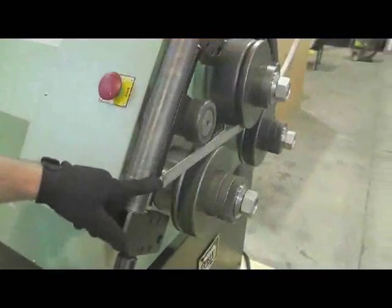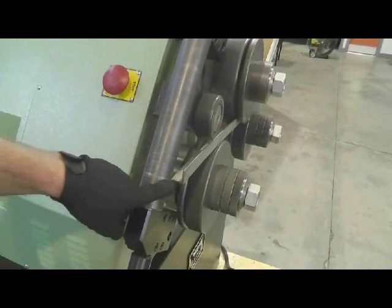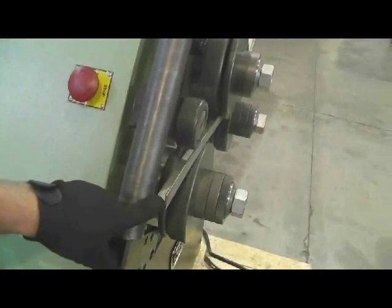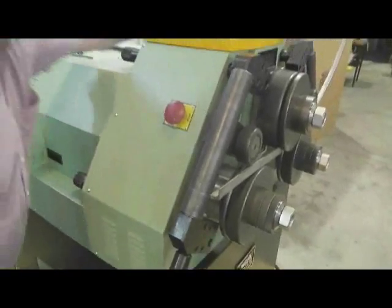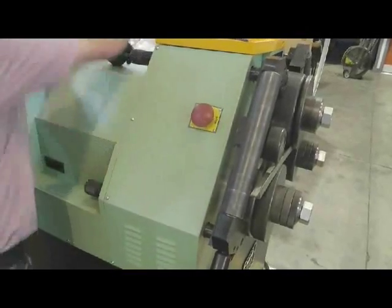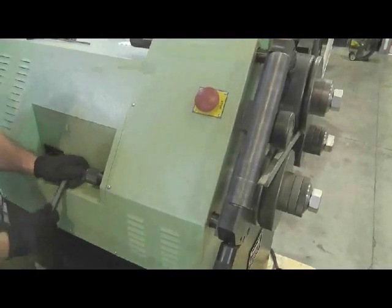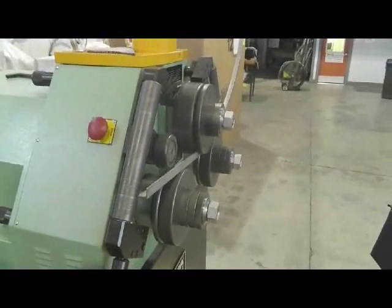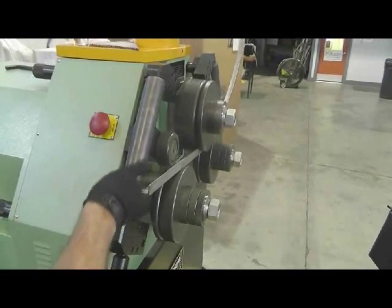With this small angle — it's actually smaller than the cam roller here — instead of using the long roller to help guide the material through, I'm going to back this up and engage the cam roller to capture the profile and hold it in line. I'll back off of this lateral guide. That looks pretty good. When I move the forming roll down, this roll is going to kick up, so I'm not going to capture it just yet — I'm going to let the roll pick it up.